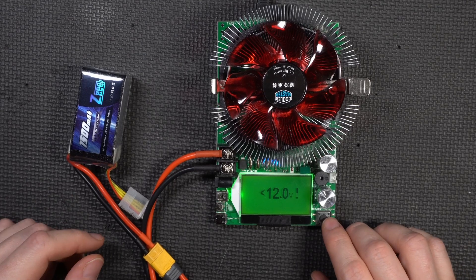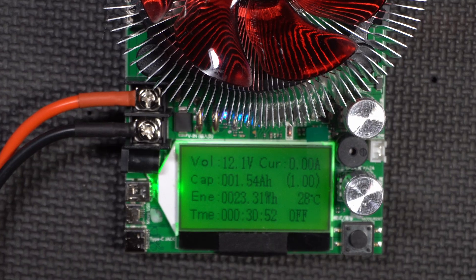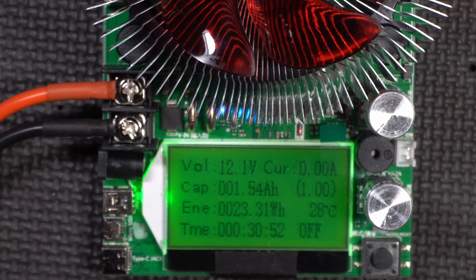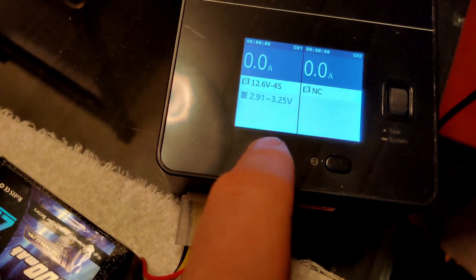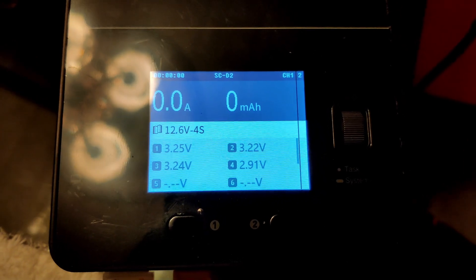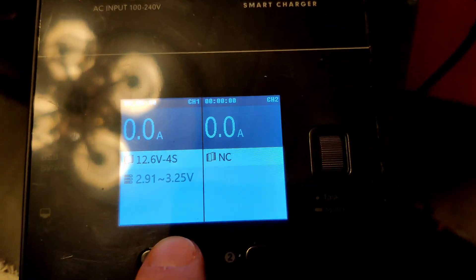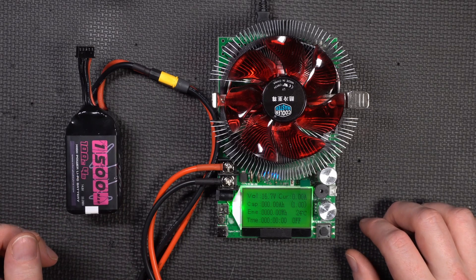I sat down to record and it literally just stopped — I was looking at it. Let's see where it ended up: 1,540 milliamp-hours. So it meets its rating absolutely. I noticed this when I put the Z battery back on the charger: look at the voltage of cell number four — that's pretty low. That cell is definitely the weak one. The others are kind of in the ballpark, but that one is not so good.